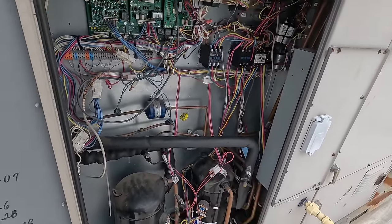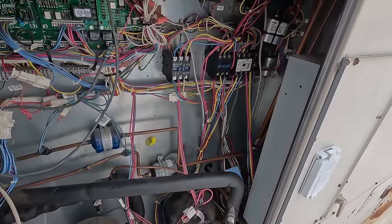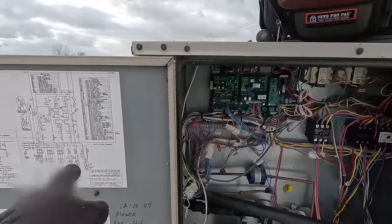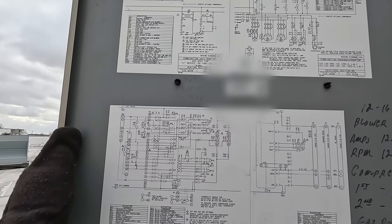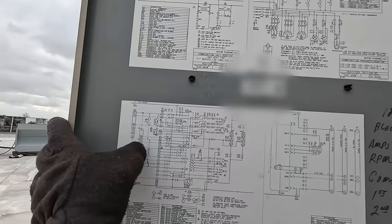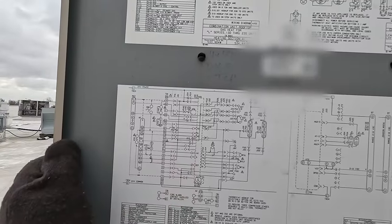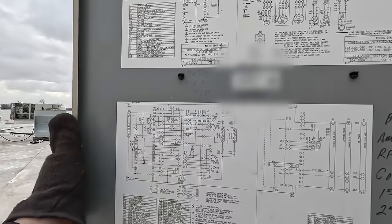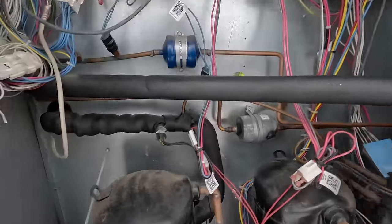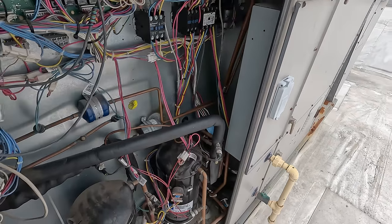There it goes! What do you know — I'm not totally crazy, huh? That's what it was. Go figure, right? That gets some heat going. We are running on W1 — so basically what it's doing is going down there, turning on the main valve, probably for low. This fluctuates the high. These schematics are some of the worst in the industry, so it's nearly impossible to read. There's W2 coming across, goes to a plug, another plug, and then theoretically it gets lost right there. The controller is bad — this one works. We'll go ahead and remount that back up. We'll give them a new controller — it's putting out heat.